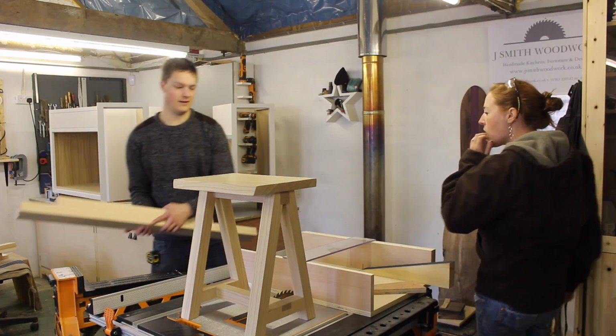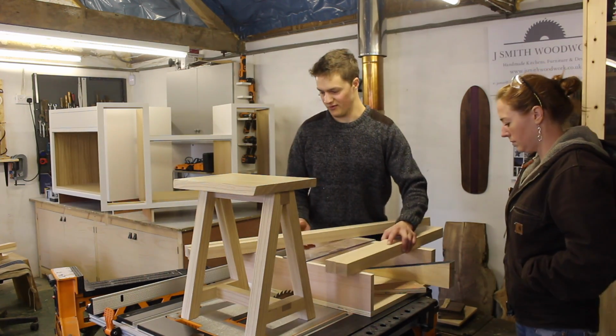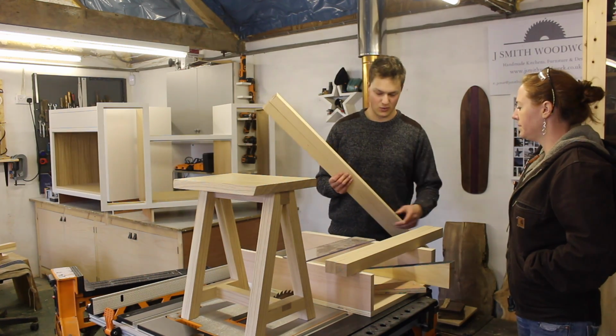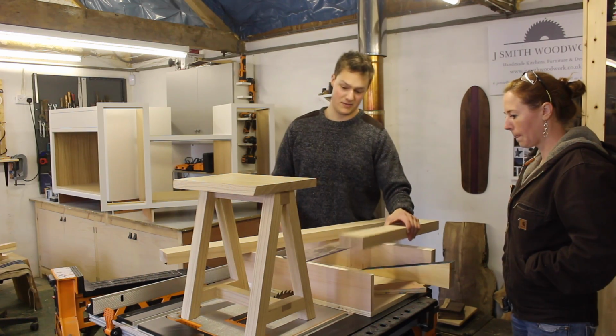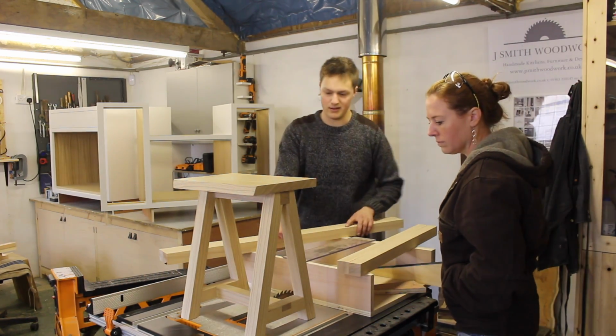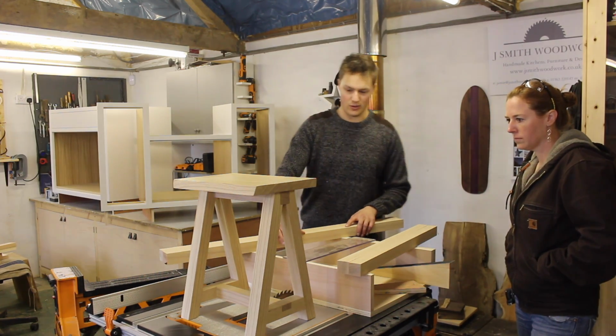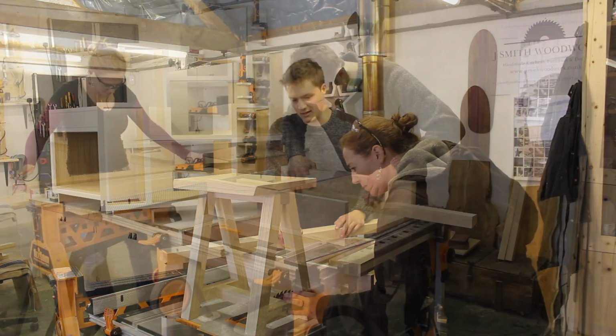Let's go. So what we're looking to build is one of these stools here, out of the timber that I've currently got. So I'm going to get my 4 legs out of these pieces, and it's all going to be cut to length using the crosscut sled on the work centre. And then these pieces here are going to do all the cross-section framework underneath and in between. And then we're going to use the duo doweler to dowel all the joints, and then it's just going to be glued and clamped together.